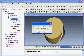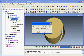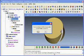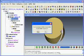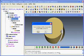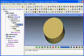But what you'll notice in the logger window is that it shows there's been an adjustment of -24.777. In other words, it's actually reduced the length of the tool. I'm going to say no to that. I'm going to reset. The other thing I'd like to show is it working against the fixture.